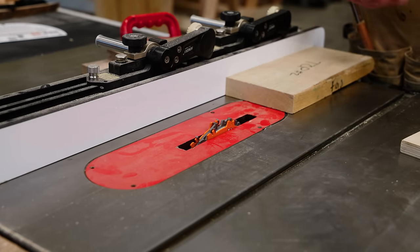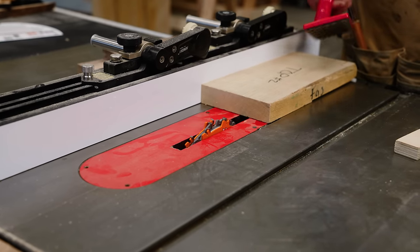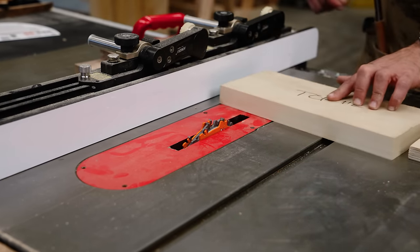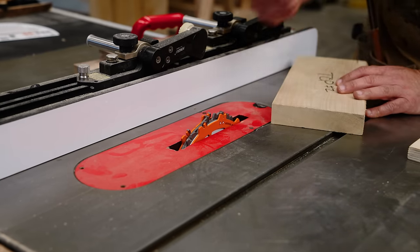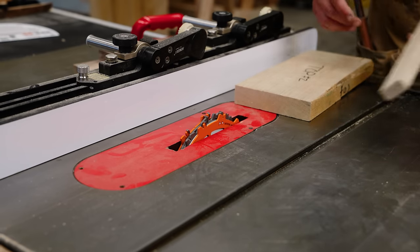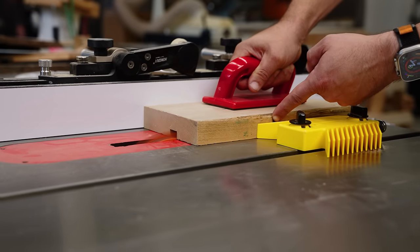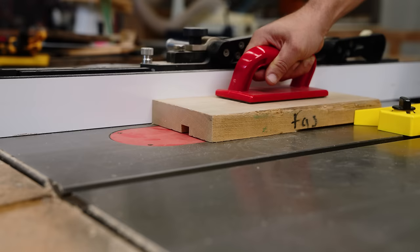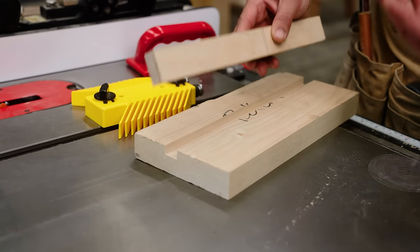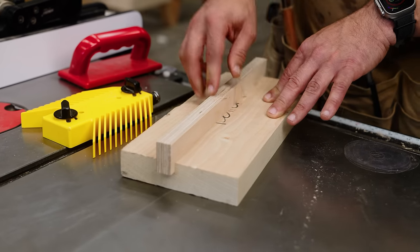There are two types of cuts: rip and crosscut. Don't push the board over the blade with just your hand — there are many things that can go wrong. Use a good quality push pad. If you have to make a huge cut, especially with an underpowered table saw, you don't have to do it in one pass. Take a quick test pass and ensure you have a perfect setup. If we did this right, the piece should slip in relatively easily with a little friction but without needing to be pounded in. Perfect fit.